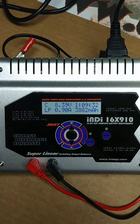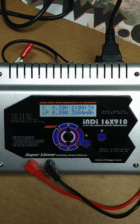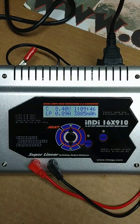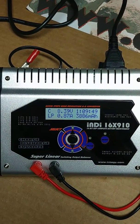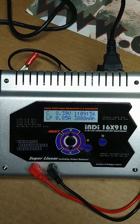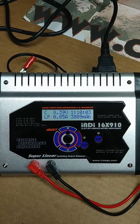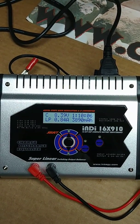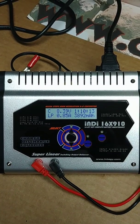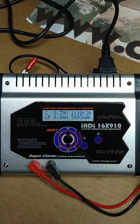Coming back for a fourth time — we're at just over an hour and nine minutes. We've put in just over 3,800 milliamps into the unit. Current pack voltage is 8.39 volts. The charge current is continuously going down because as the pack gets closer to being completely charged, it keeps dropping the amperage, even though we had it set at 4 amps to begin with. I would recommend only charging it at 4 amps — it can handle faster charging, but you'll get a lot longer life out of your battery if you keep it around 4 amps for this one.